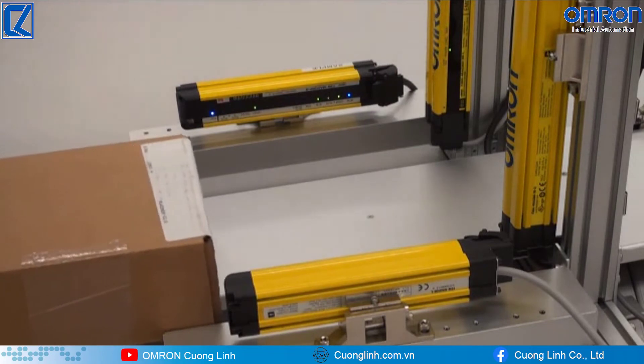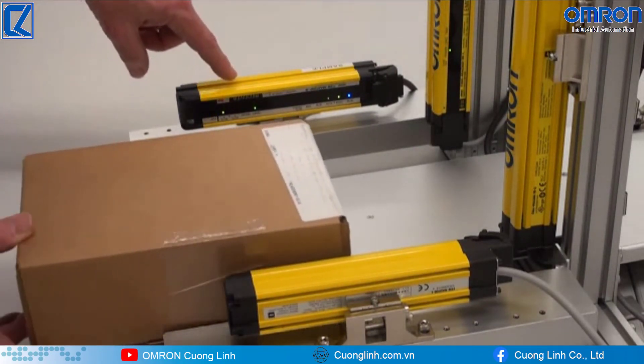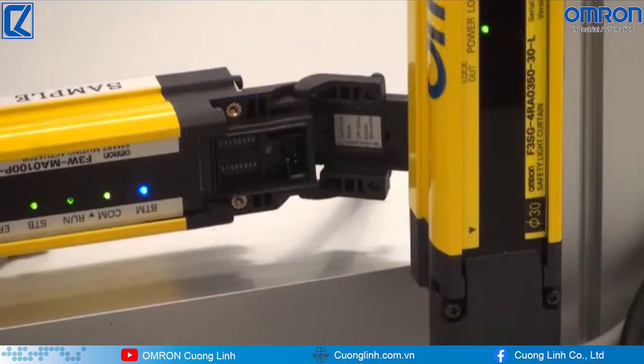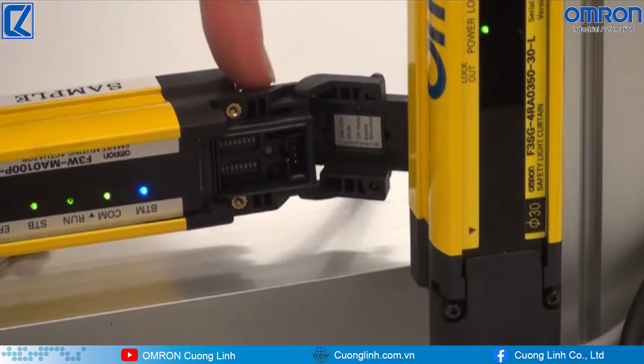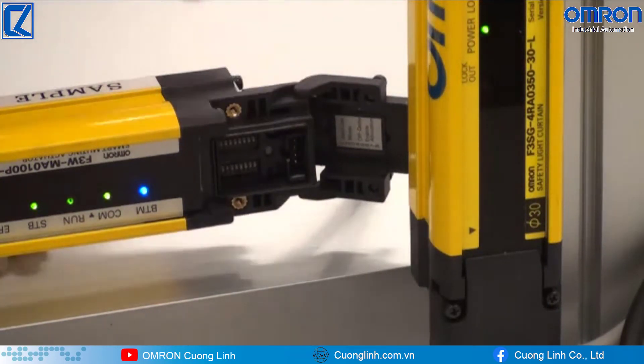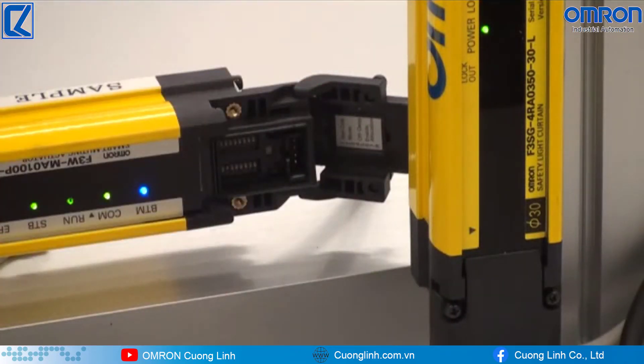When we do mute, you're going to have muting A illuminated, and then you're going to go to muting B. Now it's in the muting actuation phase. I want to show where the DIP switches are located on the smart muting actuator — right here where we're zoomed in. Some of the functionality: you can change the scan code selection, which is the modulation frequency of the emitter; the operation mode for chattering or anti-chattering; and there's a DIP switch for off delay, muting enable, and trigger beams. On the transmitter side, they have a few DIP switches there too.